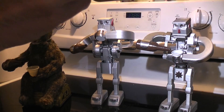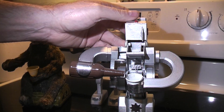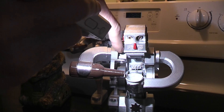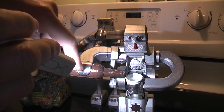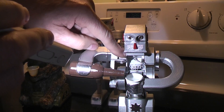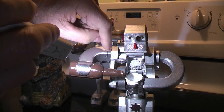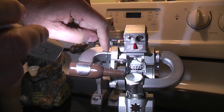If you look down in the mouth area here — let's get Jocko closer — the water just goes down this trough in the back. There's a little tube right there. The entire arm and bottle are all 3D printed as one piece, so they're water tight. That tube in Jocko is only an inch and a quarter long — about 30 millimeters — because it doesn't need to go any further than here. It does need to be flexible since the arm moves, but it doesn't have to go any further than that.